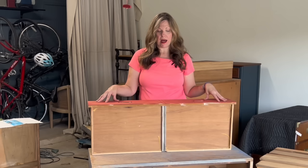My preferred method is I always go around the perimeter first, and then I fill in the interior. At the end, you'll see I come back and do nice long strokes to even everything out. If you're using a quality paint, it will self-level.